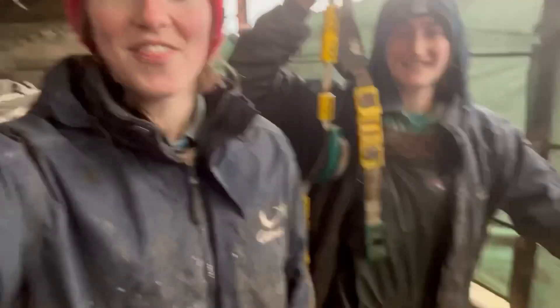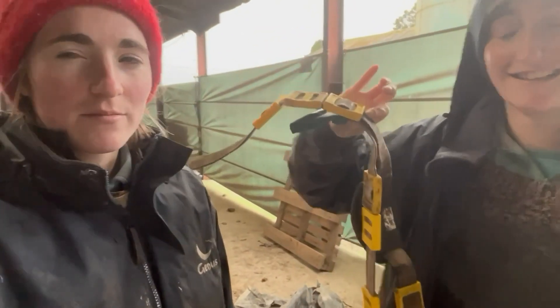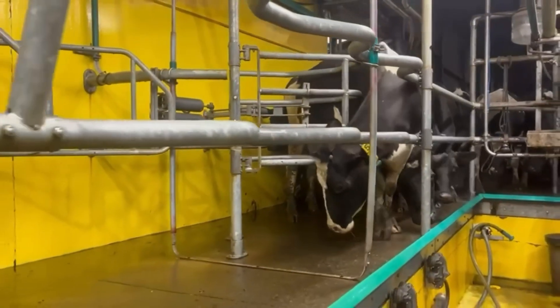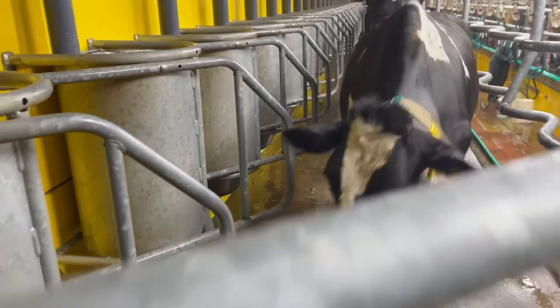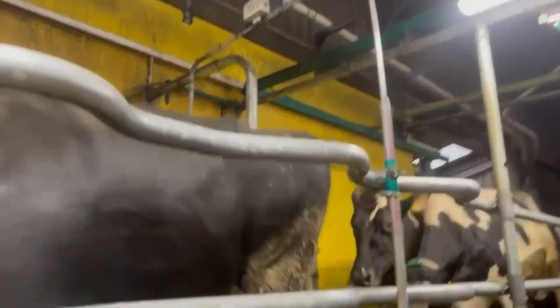So the job's done - this is the amount of collars we had left. This metal bar is the sensor which is used to detect the collars coming into the parlour. One of the main things the collar will be used for is feeding within the parlour. This cow called Sprinter is very keen for her food. Basically every single cow will get fed a different amount and this depends where they are in their lactation. If they've just calved down they're going to be having a lot more feed than someone coming to the end of their lactation. This is just to help them - if they're producing a lot of milk they need the energy and protein to produce it.